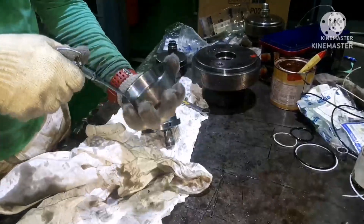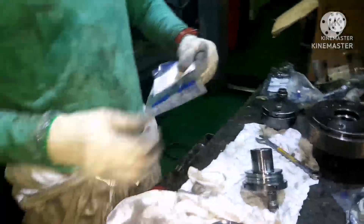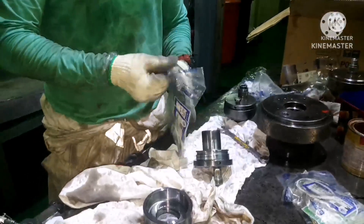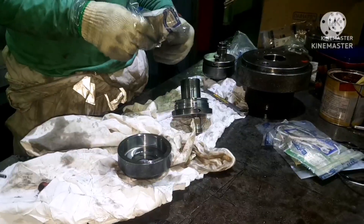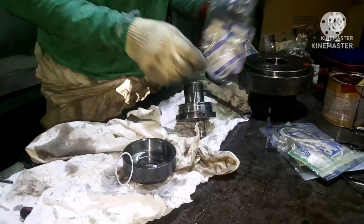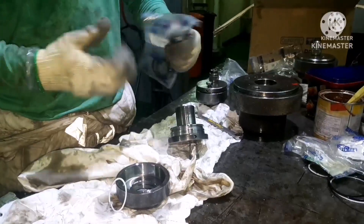We are done with cleaning. Next we need to fix the backup ring and o-ring. The main thing to notice is you have to choose the right part — ensure you are taking the right part for the correct hydraulic jack, because for generators you will usually have two or three types of jacks. Check with the parts manual and ensure the backup ring and o-ring are for the correct jack. Cross-check the manual part number with the packet you are opening to confirm they match.